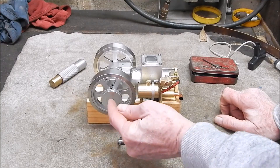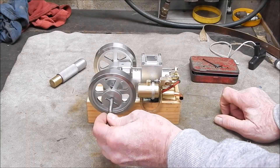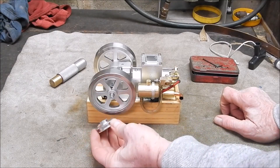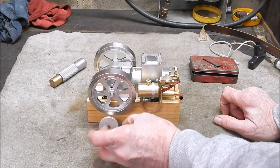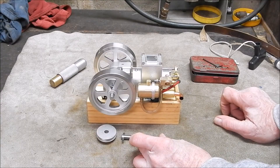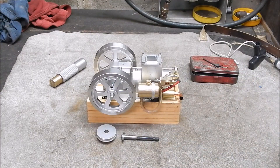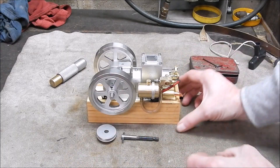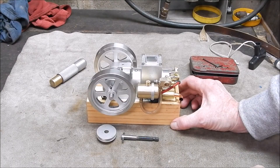The only thing to do now is to mill a slot to take the two dogs and the pulley, which comes off like that - a couple of grub screws holding it. I thought I'd show you why I'd do that and then we can try it and see if it works. I think it should. If it doesn't work with the cordless screwdriver it'll definitely work with an electric drill. But it'll make it a lot easier because you'll be able to start it without pulling the thing sideways - it's got not enough mass, you know. So this is job number one.